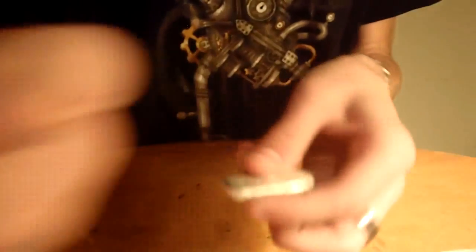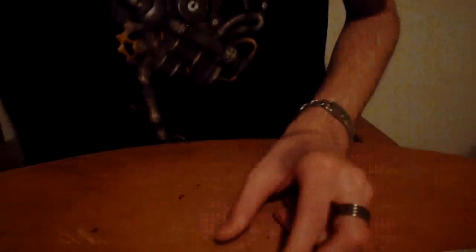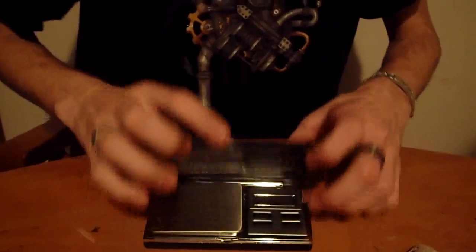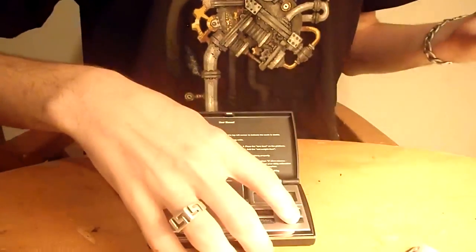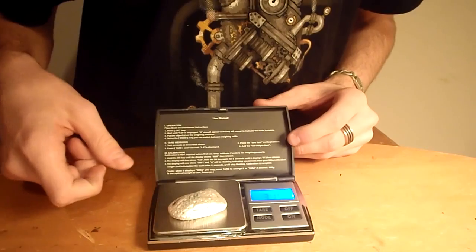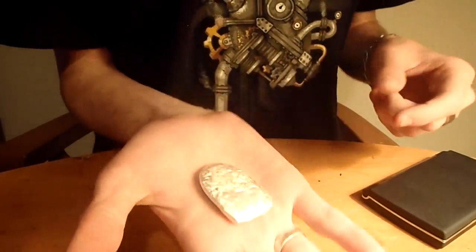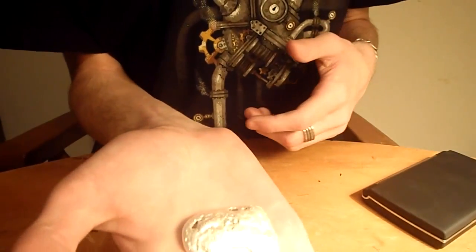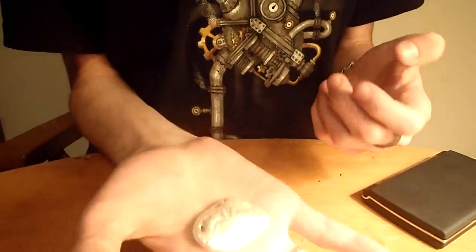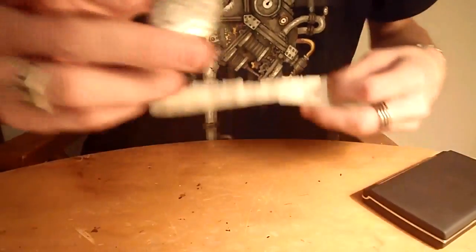Now this is the other leftover bit of silver — this is just a block of solid silver, about three troy ounces. I can show you on my scale here. I think I've made sort of an ingot. My scale is reading 3.194 ounces for this, so it's an ingot — a solid piece. It's also very shiny because of the pickle process. With the current price of sterling, this is worth well over a hundred bucks, so my time spent smelting was certainly not wasted. That is my sheet sterling, that is my ingot, and that is how you smelt silver.